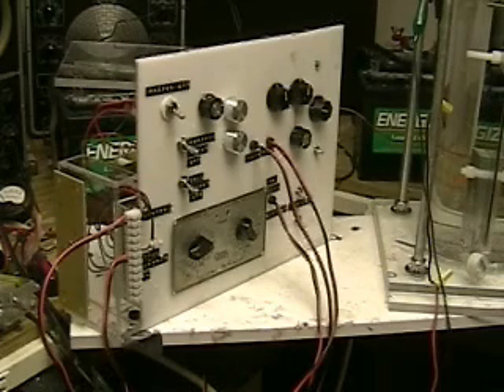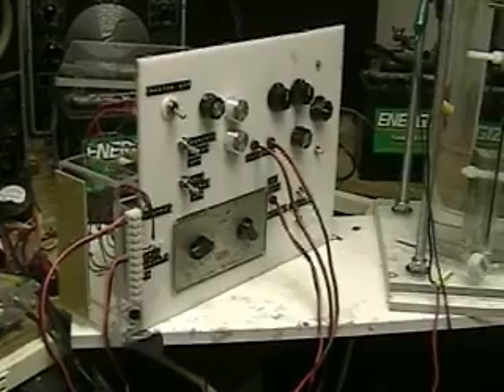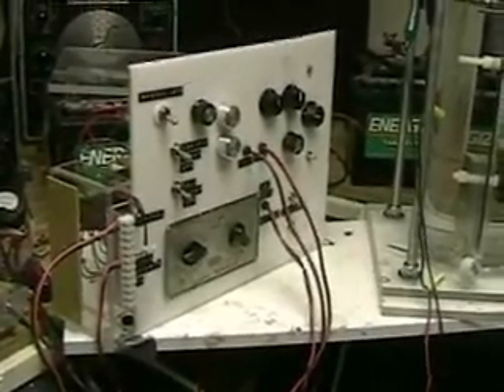This is Hydrogen Tap. What you're looking at is the pulse station that I've been building. I've added a few more components to it. On your left are two inputs: one for the control voltage on top, and one on the bottom left for the voltage that powers the cells. Those two wires coming out of the center of the board are test leads to two meters, to see the resistances that the knobs create.